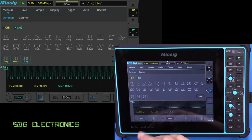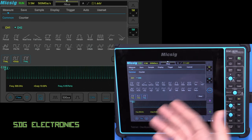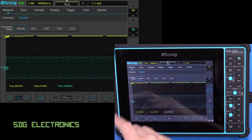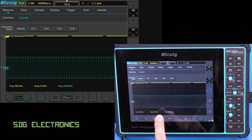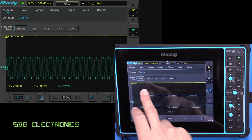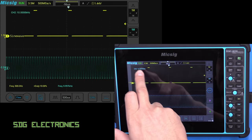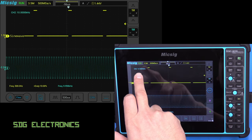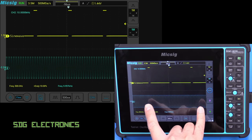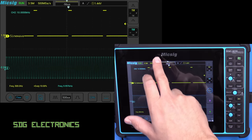Going back to the menu at the top, we've got the various measurements we can do — time or voltage, amplitude, depending on what it is you're measuring. We've also got a hardware counter. The frequency shown here is being measured based on the waveform on display, but we've also got a hardware counter. If we select channel 2 and move the menu out of the display, you can see this is using a proper frequency measurement — it's locked on to 10 kilohertz, even though the waveform-based reading is moving around as cycles move in and out of the display.